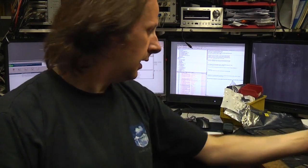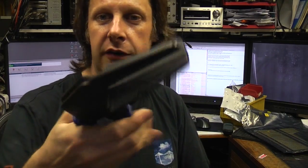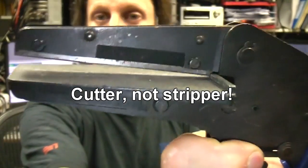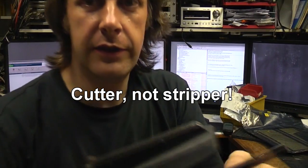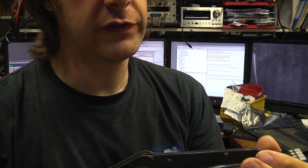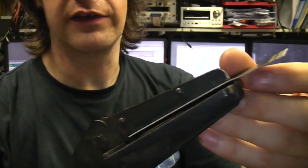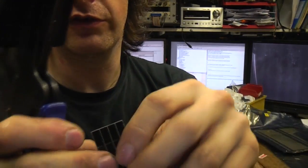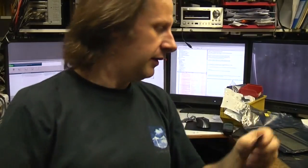You can get commercial de-panelling tools, but unfortunately the subcontractor I used didn't have one. After hunting around and trying to adapt something, I actually found this — a stripper for ribbon cable. It's basically a very long bladed tool, and it works reasonably well. It's a bit tricky to line the board up, but once lined up it cuts fairly straight. The problem is the blade isn't quite long enough for the whole board, so you've got to do both sides. Not ideal.